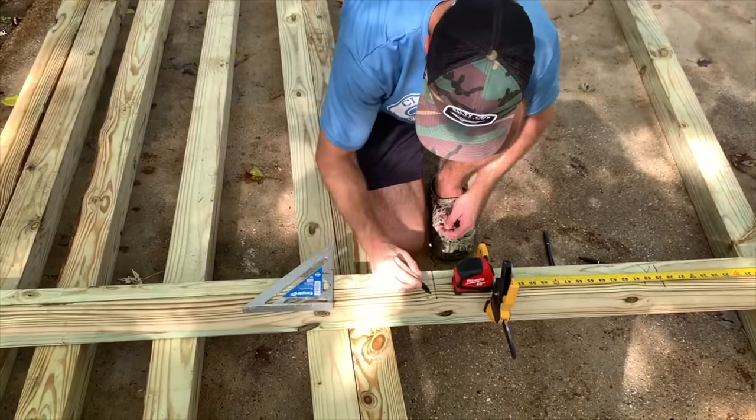So just like most epoxy products, we're gonna mix the part A and part B in equal parts in a 5-gallon bucket using the mixer attachment on our drill. Now for substrates like plywood, it's often a good idea to apply a flexible primer like Flex, because these wood subfloors will experience a lot more elongation and warpage and shrinkage over time. And you want to apply kind of a rubberized coating that will stretch and contract and shrink with the elongation and the shrinkage and expansion with that plywood. So this is basically like a rubberized coating, which is going to flex along with the plywood.